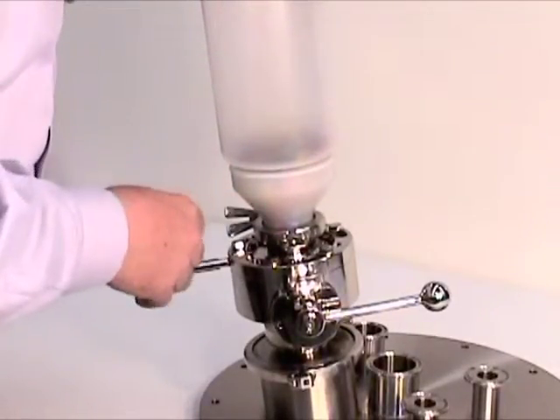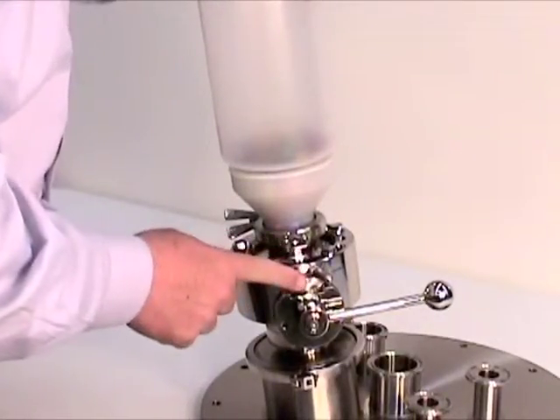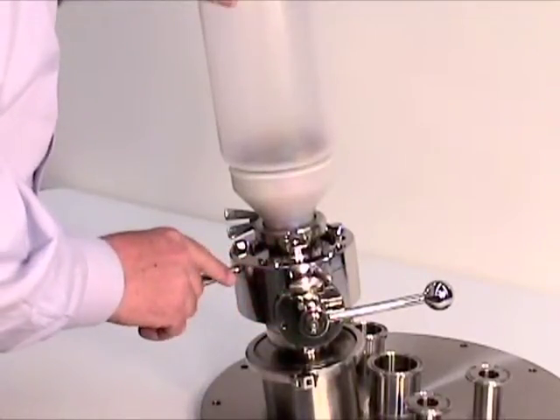Make sure that you have a basic seat. Turn the locking ring until this pin pops. Once this pin pops, this is now a bubble tight seal.